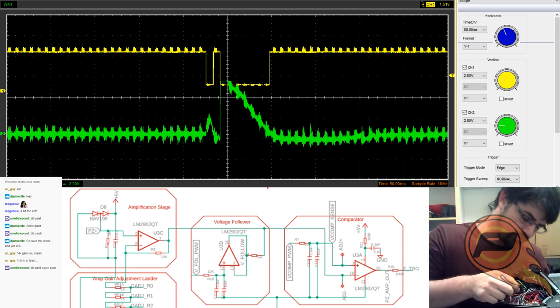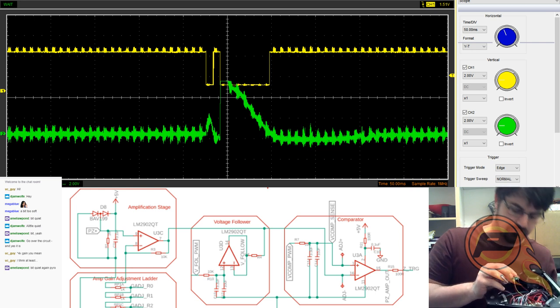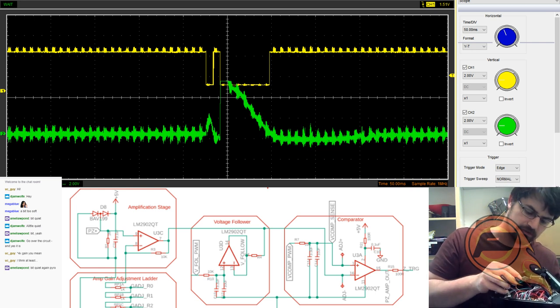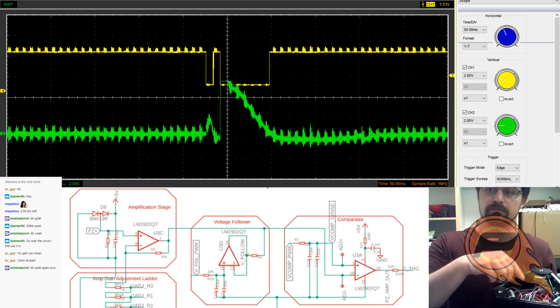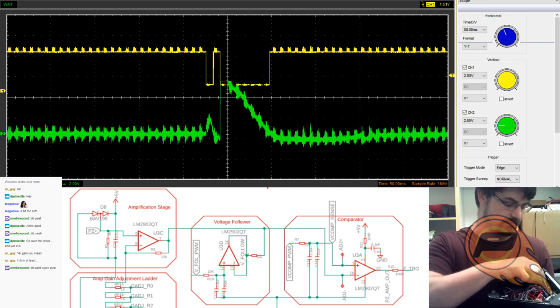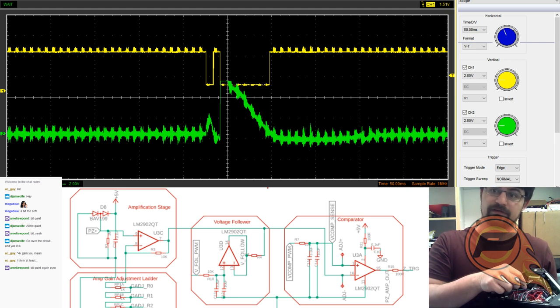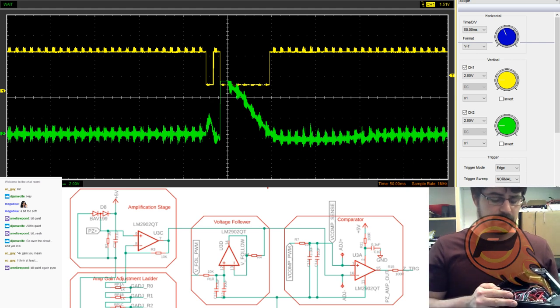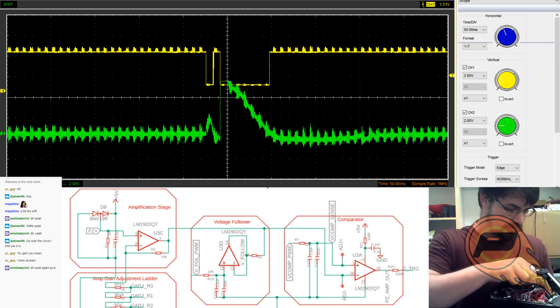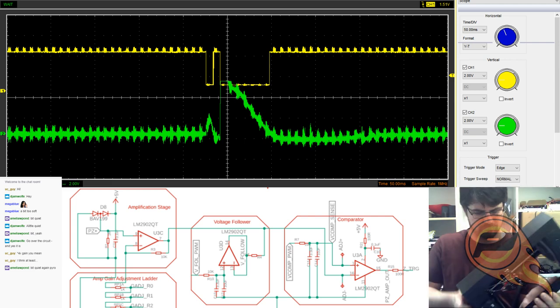And I did have to go and do the solder joint bridge on the bottom of this to bypass the voltage regulator, because it's 3.3 volt on the 32-bit processors, and this was using a 5-volt regulator. So just the 3.3 volt in from this controller works fine on it, and I will now do a demo, so that's working.